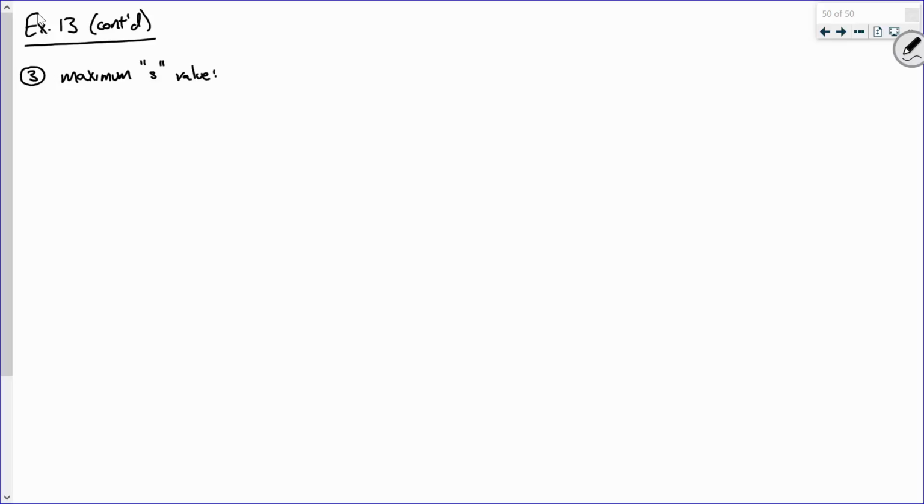All right, so there are 2 different formulas that we're going to use. I apologize that the maximum stirrup spacing calculation is a little convoluted. It is what it is in terms of the code. So we have an S max 1. Now this one's simple. It's the minimum of D over 2 or 24 inches. Sorry, thank you, I'm getting ahead of myself. What is D for this beam? Nope, 25.